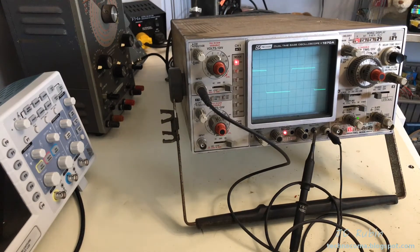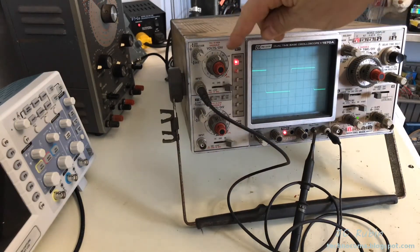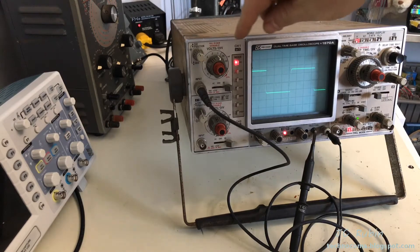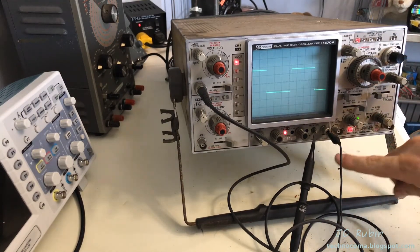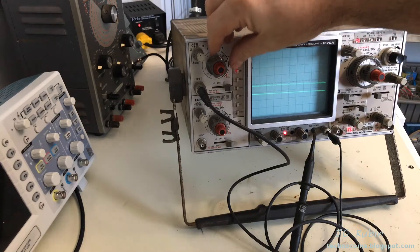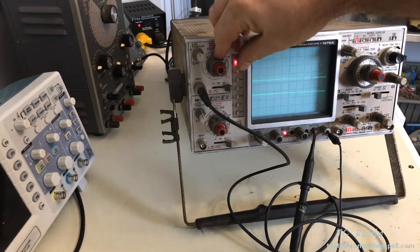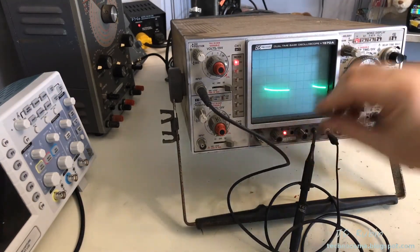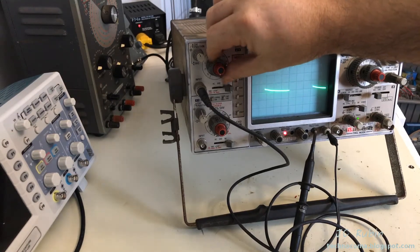That said, it's infinitely better if you needed a four-channel oscilloscope and didn't have one. For the purposes of channel one, this is the best condition on this oscilloscope because channel one is used most often, so these knobs are actuated more than any others. If we look at the waveform — the calibrating waveform, one volt peak-to-peak at one kilohertz — if I touch it you can see that we have a crackle. The contacts are definitely dirty; you can see this one is all over the place.